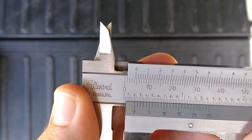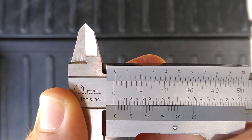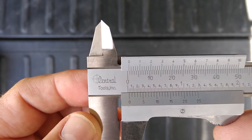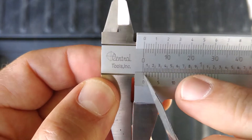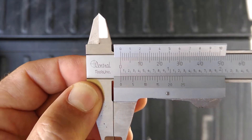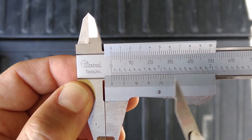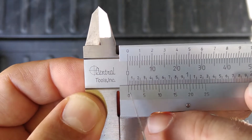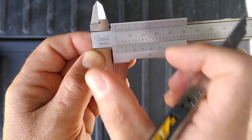Now if I bring that zero to about here — the zero is your pointer, that's where you take your initial reading from. It's pointing to the first twenty-five thousandths of an inch. But what if it's a little before that? How do you know exactly where your pointer is — is it nine thousandths, twelve thousandths? That is where the vernier scale comes in. These marks from zero to twenty-five are your one-thousandth divisions. The vernier scale takes that division and zooms it out, blows it up, so we can take a precise reading.